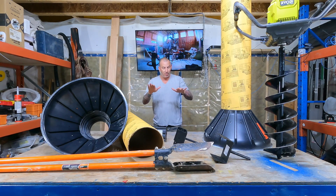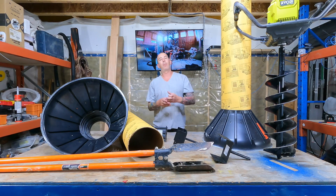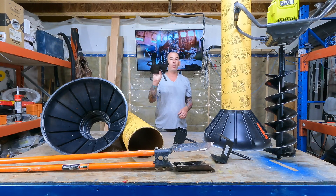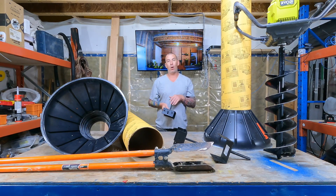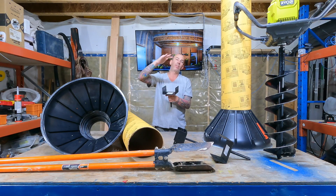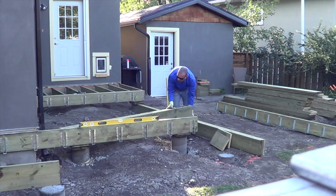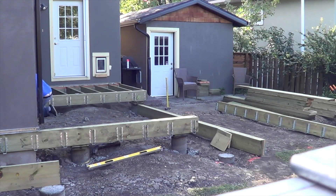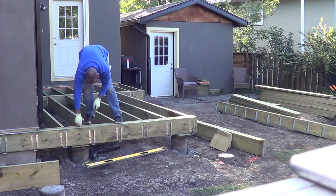Bearing the fins down on that soil, not allowing it to push further down into the earth. The metal pipe is usually cut off and a plate is installed, or a saddle would be installed. In this video, you'll see that I'll put saddles on higher tubes that are out of the ground where I'm going to put a lengthy post. On a couple of jobs, it's just an inch and a half spacer — a saddle isn't really required in that situation. It's more of a patio style deck, so I just put some pressure treated blocks in there and secure them with some scabs of wood on the side.